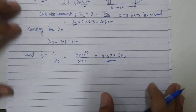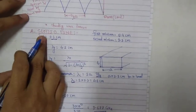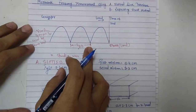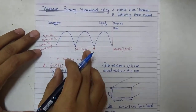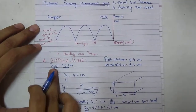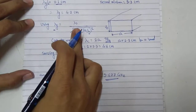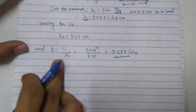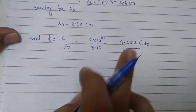So this is the first technique, called the slotted line technique. You measure the distance between adjacent minimas in the VSWR pattern inside the waveguide, calculate λg from λg/2, use the waveguide dispersion equation with the cutoff wavelength to calculate λ0, and that gives you the frequency.